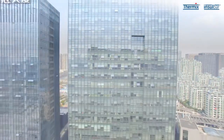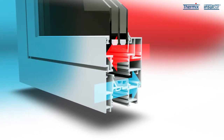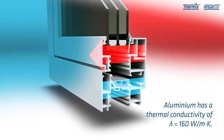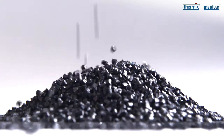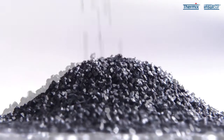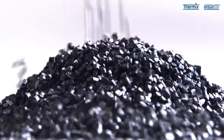But aluminium frames are also extremely conductive. This means that they conduct heat from the inside of the building to the outside. Preventing this from happening is where we and this plastic granulate come in. Plastic, and primarily polyamide 6-6, has only minimal thermal conductivity, making it the ideal material to thermally separate the outer and inner frame of an aluminium window.